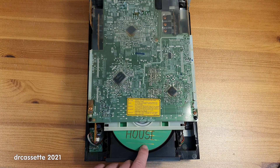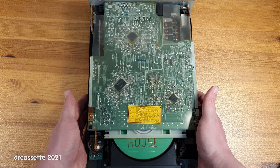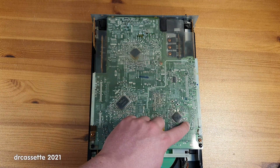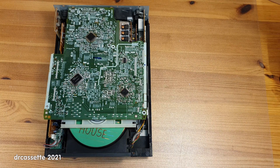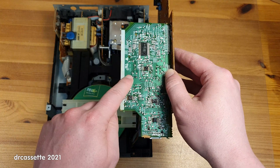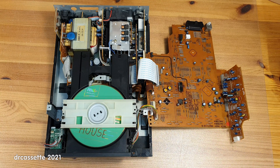As you can see, there is still a CD in here, which apparently contains house music, so I will give that a listen. The circuit board on the top seems to be all for the CD player, because there are various test points all over this board — right here and right here — and those are all related to the CD player. After taking out some more screws and a cable, this entire board comes out and folds over along with this daughter board. All of the other cables connect along here, so the system was designed with serviceability in mind. Well done, Pioneer.